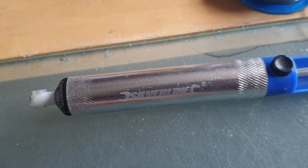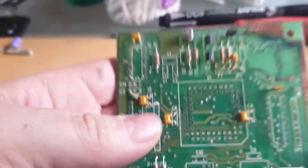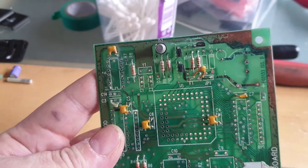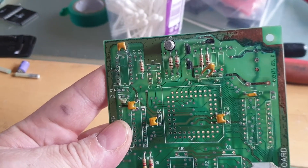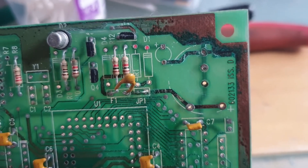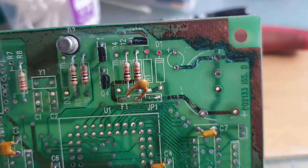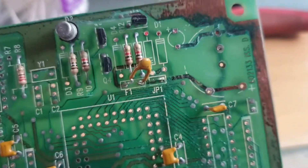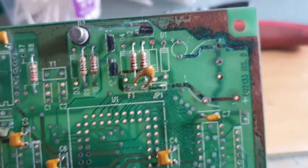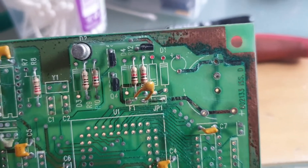This is a board - this is a JPM Impact processor card, sorry for itself. We've got a battery plus area there, and if you look at the top bit there isn't a minus marked but the minus is the top. So you want to put a fly lead in from the plus points which are at the bottom - one or both, doesn't matter because it'll work - and one into the top.